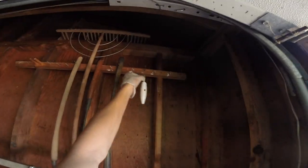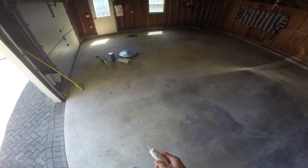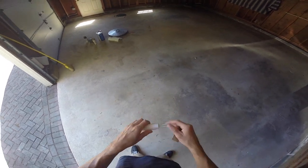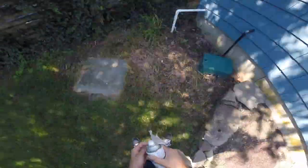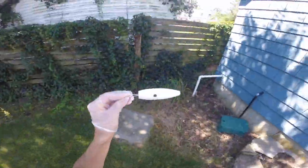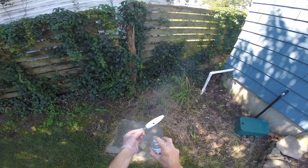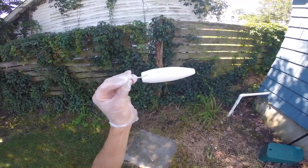After the light dusting of paint I'm just letting it hang up to dry. The priming coat is dry and it'll be a little gritty, so I'm giving it a very light sanding with 220. Now I'm going to give it the final top coats — I do two just to get it a little more glossy and cover up any wood grain that might be showing through. Doing two lighter coats instead of one thick one will also cut down on drips, and then I'm going to let it dry for 48 hours.